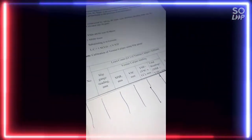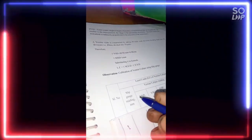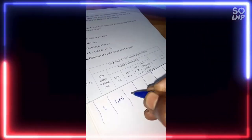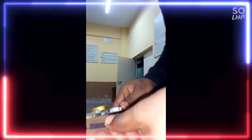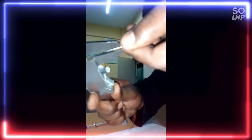We are going to take a reading for this slip gauge, that is 1.05 mm. So we have to fill the observation table. Serial number will be 1 and the slip gauge reading in mm is 1.05. After that we have to take the reading. In order to do that, we have to keep the slip gauge like this and lock the screw.